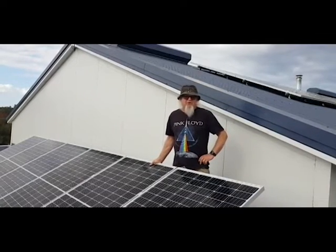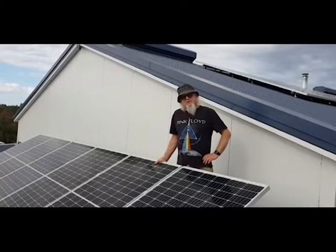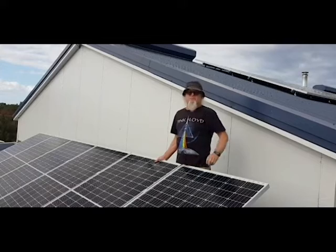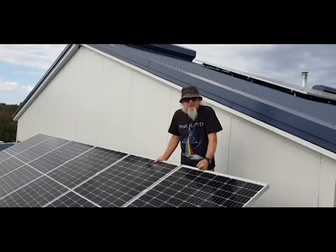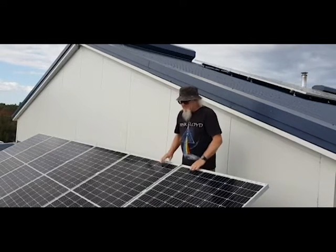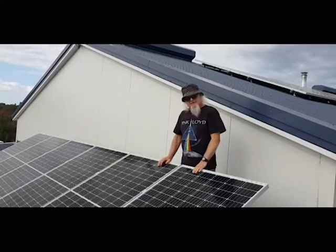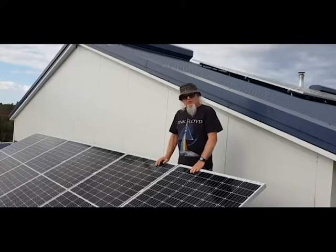G'day, Andy here again. We're going to talk about the solar array on our roof. We talked about the shed solar previously; now we're talking about the main house solar system. In other episodes we'll cover the greenhouse, hot water system, ATU system and the rest. Today we're focusing on the solar. We've got three sets of panels on this house: an east-facing panel at 1.5 kilowatts tipped up at about 30 degrees to catch the morning sun, another array in the middle of the roof facing north, and a west-side array to catch the afternoon sun.